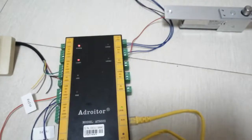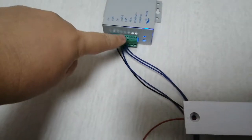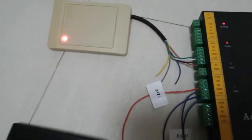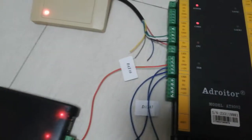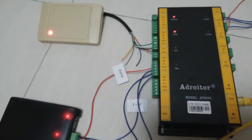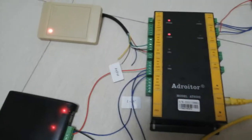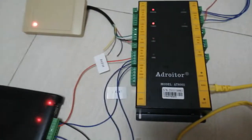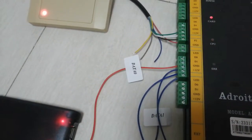You can also check the wiring guide in this chapter. Connect the external power to the power terminal, then connect the reader to the relevant pins — specifically D0 and D1. The controller supports Wiegand 26 up to a maximum wide card format range, so make sure to insert the reader into the correct D0 and D1 pins, otherwise there will be no response.